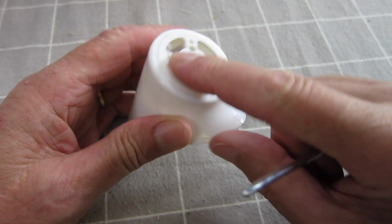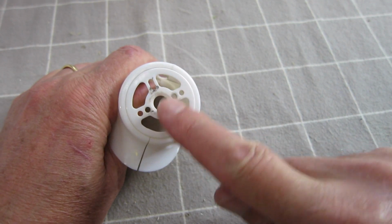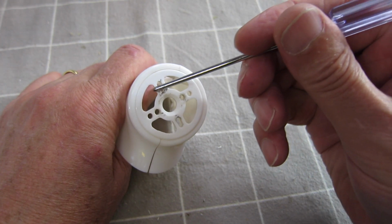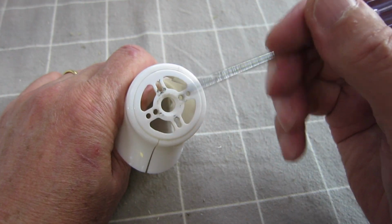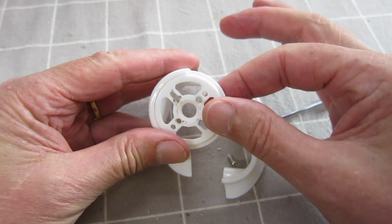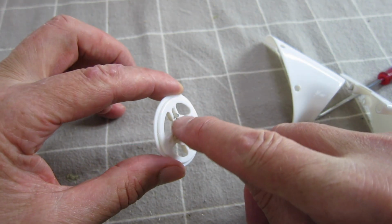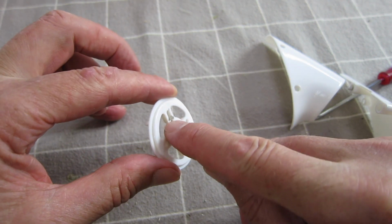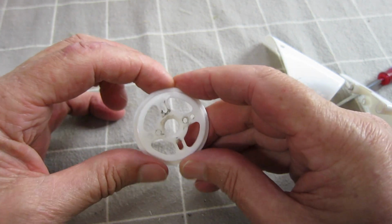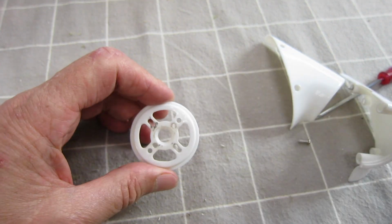So this little disc is the problem, and you can see that there isn't much material actually holding the disc together, and I can just imagine any little crack across here or across here could be a disaster. There's just screws holding the casing together. Let's pull that out. You can see how thin and delicate that is. These little parts here are only 1.5 mm by 2 mm of hard, brittle plastic. Not good enough, I don't think, for a decent sized motor on a serious plane.